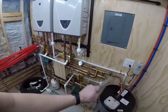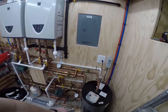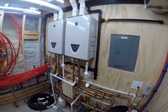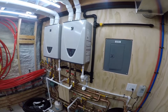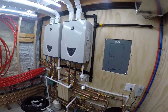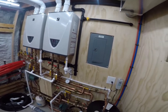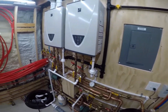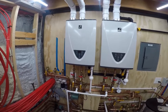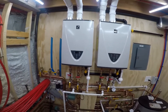If you can only heat up 4.3 and you're drawing 6, it's eventually going to be replaced with cold water. But now with both of them easy-linked together at a total of high 7s, almost 8 gallons a minute — that's three showers or a bunch of fixtures on at once. And that also includes the heat or the snow melt being on, and it'll still keep up with the hot water.